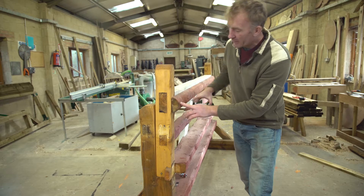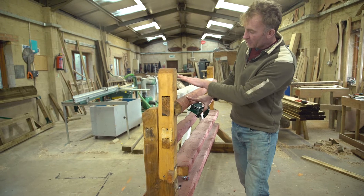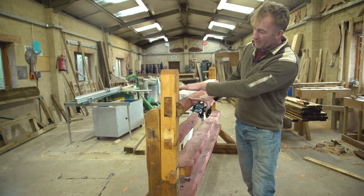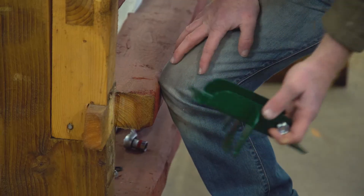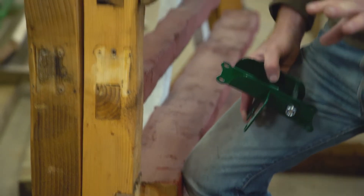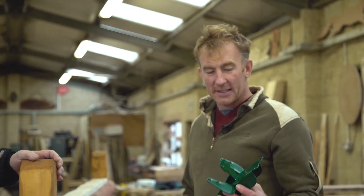I've decided this one, for the look of the fence, needs to be about 50 percent of the height of it — which is fine. But the only rule we must stick to is we must be at least 25 centimeters from the top of the fence to the hinge. That is a minimum; anything below that we can use.